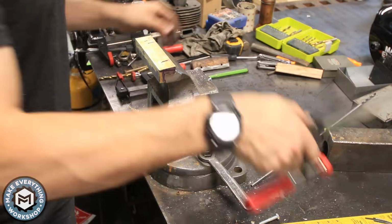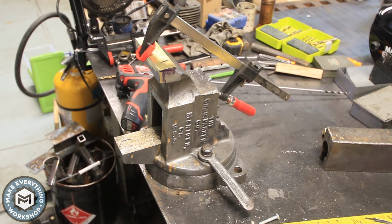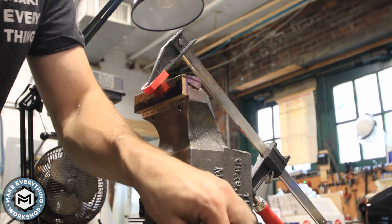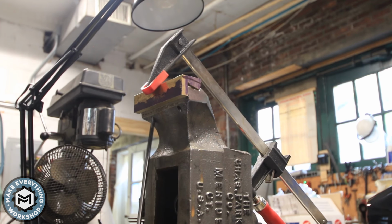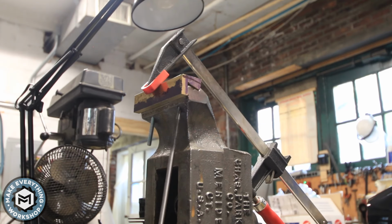So even when you're labeling your parts and making sure that you're doing things in the right order, it's easy to make a mistake like that. But luckily I salvaged it. And here's just a little bit better of an angle where you can see using that long drill bit to take the drill angle and reference it off of the actual vise and drill up through that brass.